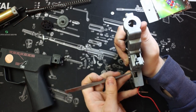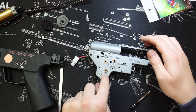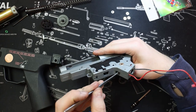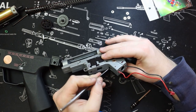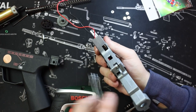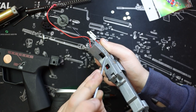That seems to have a bit more room to spin with not too much play — looking good. Now you can't just hold the case closed because your hands aren't putting the same pressure that your screws will, so we're going to put in the three screws that are around the gear parts and tighten those down as if we're putting the gun back together properly. After tightening and moving a brass washer to the bottom, there's not too much play in that gear and it happily spins. We know we need at least 0.3mm on the bottom to shift it up enough.